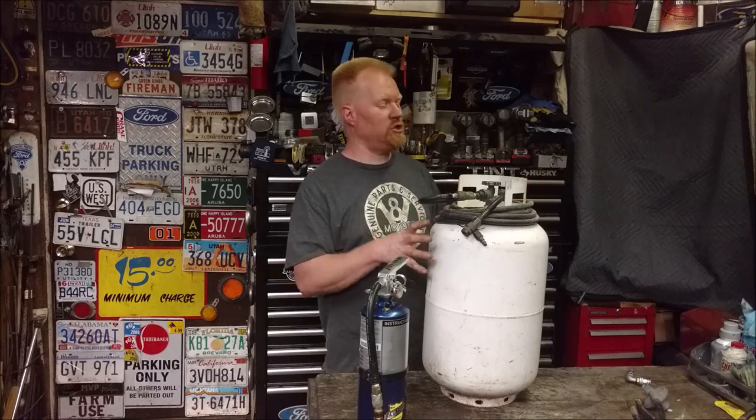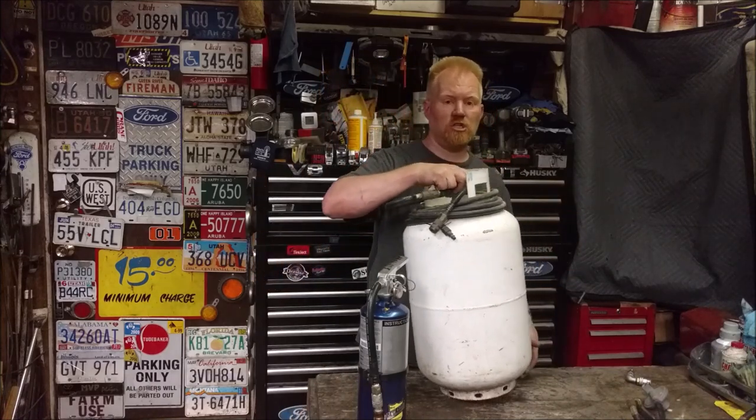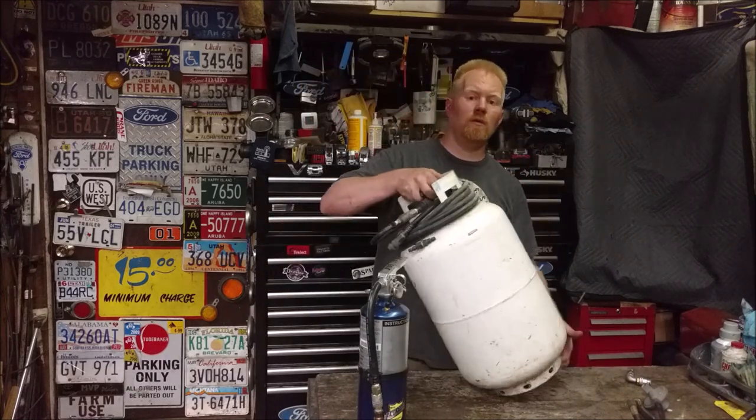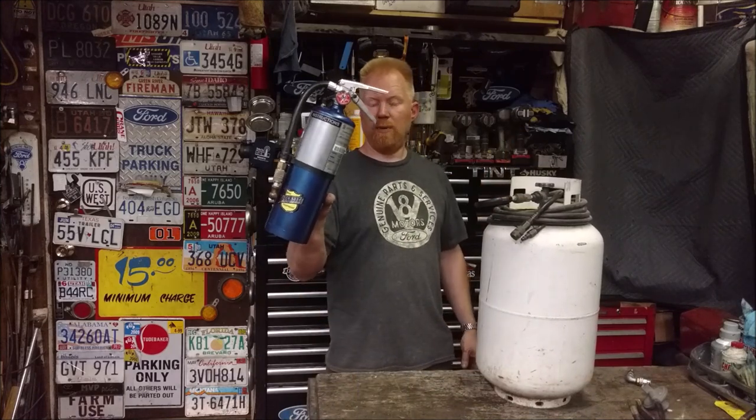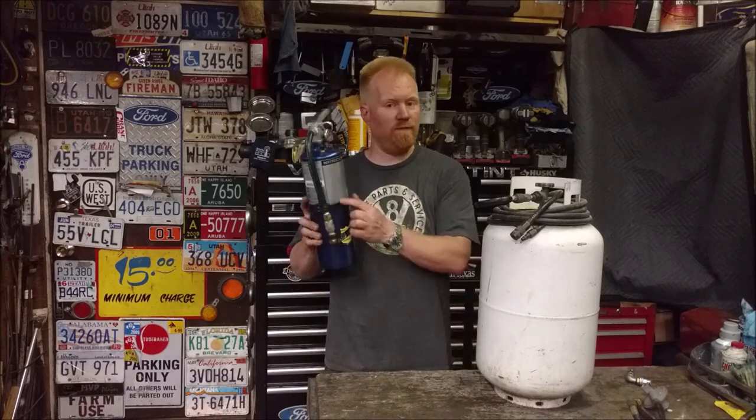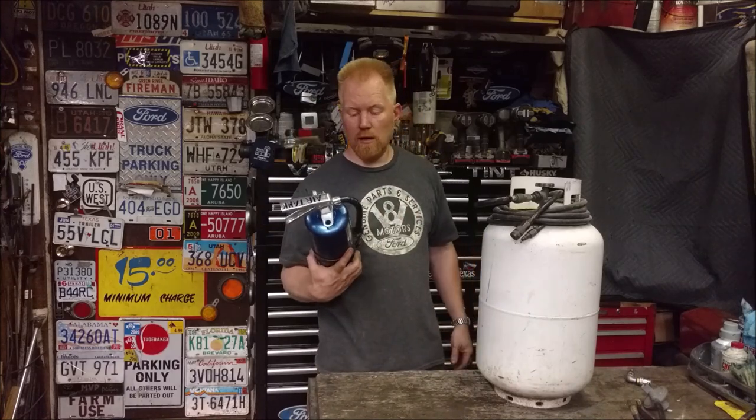If you're concerned about moisture and water, there are a couple of things you can do. One is to put a filter dryer on your air compressor. The other thing is if you think water has accumulated, you can just turn the tank upside down, open the valve, and any accumulated water will blow out — similar to having a drain valve on the bottom of a regular compressor. You guys asked to see it after the fire extinguisher video. I did paint it blue so you can't mistake it for a fire extinguisher. It says 'air tank' and I took all the fire instructions off.